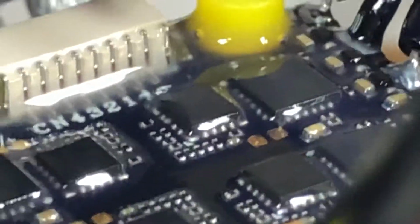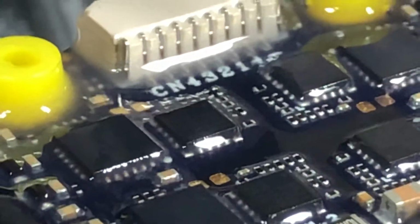And yeah, I've put quite a bit of conformal coating on there. But I won't do anything other than that now with all my builds. They all get a good coating, and I let that dry. So I'll probably let this dry overnight, and I'll flip it over to the other side, let that dry overnight. Although you don't have to, it dries fairly quick. But I've put a really thick coating on here.